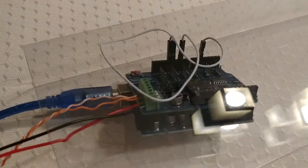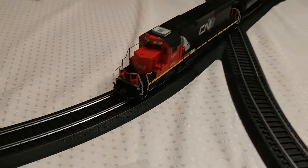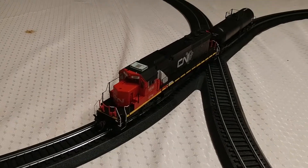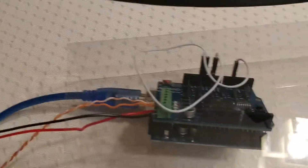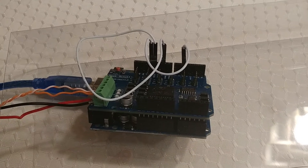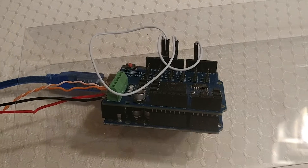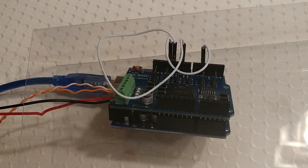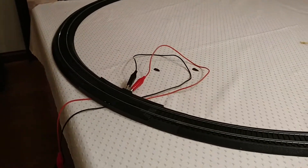Normally a decoder costs a couple hundred dollars, and this engine actually cost a hundred and twenty dollars, so it's a little pricey for a toy — although I guess it's not really considered a toy anymore. This is an Arduino with a motor controller on it, and there's a program called DCC++ which you can upload to the Arduino. You use the motor controller and hook it right up to the tracks to actually send DCC signals to the train.